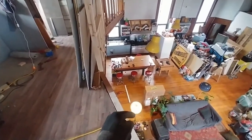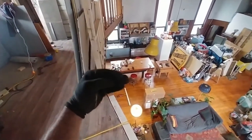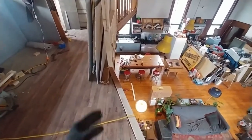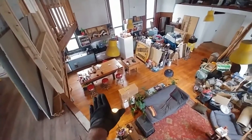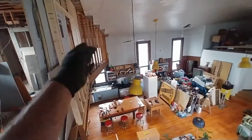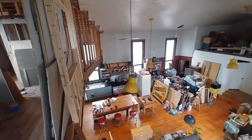Then we'll put it in an acute angle hanger on this end, acute angle hanger on that end, and we'll just fill in joists to it like this. And then we'll probably cut the subfloor back to the appropriate spot and put a new piece of subfloor from the existing landing right out onto the additional landing, all as a best practice. And we'll have to remove these walls to do that essentially. But this straight section could slide back out and be added to.